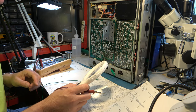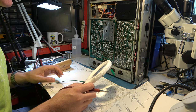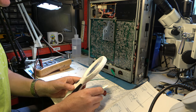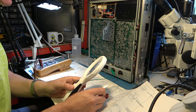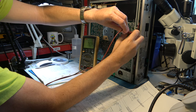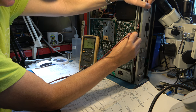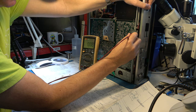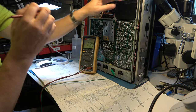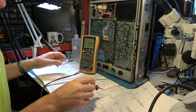We do know that the eject solenoid is being activated, so we can trace back why. Let's confirm first that the eject solenoid should have a low voltage on that output, because the other side is held to 12 volts — that's CN7 pin 1. We'll be able to confirm that that output is low. That's why the solenoid to eject the tape is operating; we can trace back why that's true.